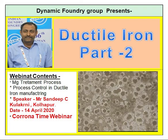Next thing is alloy covering. I told you that alloy covering, that is covering punching, also depends on the quality of the punching itself, how much has to be added. If the punching is lighter in weight, lighter in thickness, you have to add a little more because it will melt fast. So again I would like to remind you, the alloy covering depends on your tapping temperature, your bath sulfur, your last heat residual magnesium, and also your covering punching quality. If the quality of covering punching is good, you have to add less magnesium. If the quality is bad, you have to add more magnesium. So this is very important again.